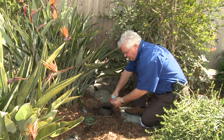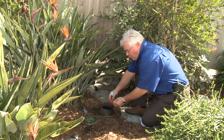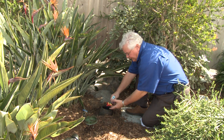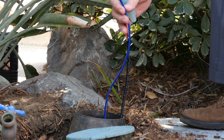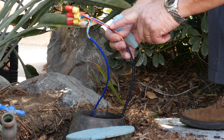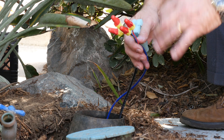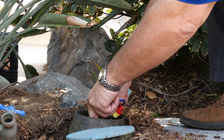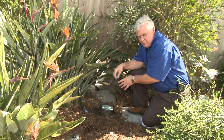We're at the final stage of completing the soil moisture sensor installation. The first step was installing the SMI board at the controller and properly wiring it by colors. The second step was selecting the depth of the moisture sensor in the field for the plants being monitored. Now we bring the splice back to a valve box — everything has to be installed in a valve box — with 12 to 18 inches of wire. Use the specified double-jacketed shielded twisted wire; it's color-coded, and if it's not wired properly it will not work. Use the DBR Y6 wire connectors with the splice kits. When completed, put it in the valve box, cover it up, and log where that splice is located in the field on your as-built.